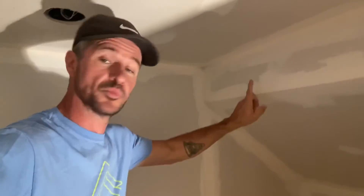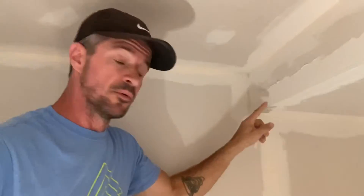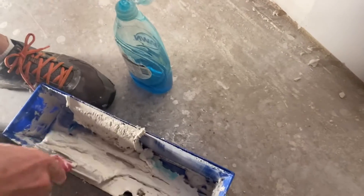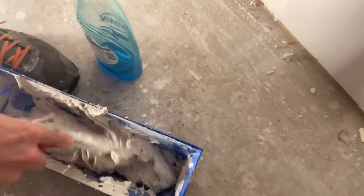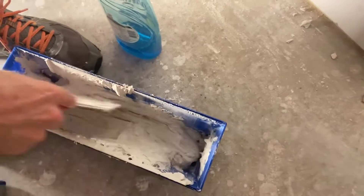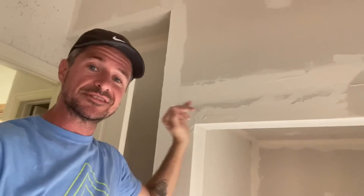It looks really nice, but it's a little rough — it's only one coat of mud on everything, and there are a lot of spots where you can see some voids. You can see this corner popping up a little bit, so we need to do another coat. I'm adding a little bit of dish soap to the mud, and when you do that you're able to get a better texture — it becomes a little less porous and a lot more smooth so you don't have bubbles. That was a trick I learned from my neighbor. I'm going through and second-coating everything we did yesterday, and I'm hoping I can just do a second coat, get a good sand, and then put the texture on so I can paint it.